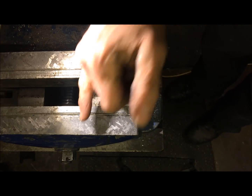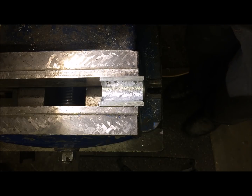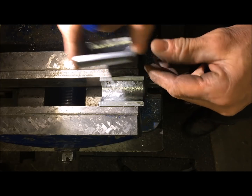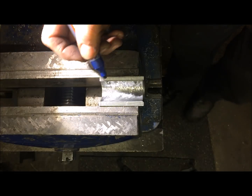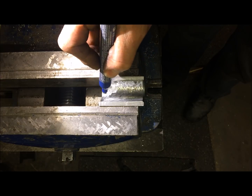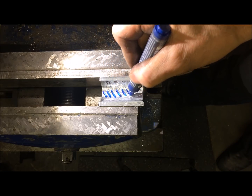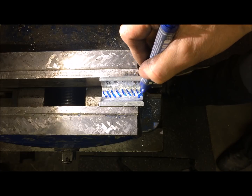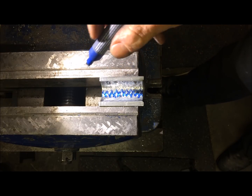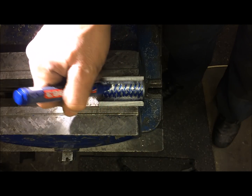Since it is hard to show how I'm scraping inside the bearing on the Myford, I'll take the liberty to use a piece of suitable, quite soft metal here, and show how I'm trying to scrape the bearing. So I'm trying to make lines, or marks, just like for normal scraping, but going inside and out — in lines — that's just my personal preference.